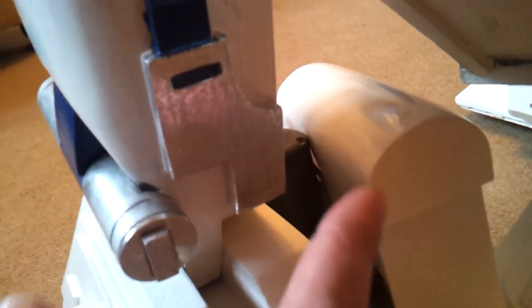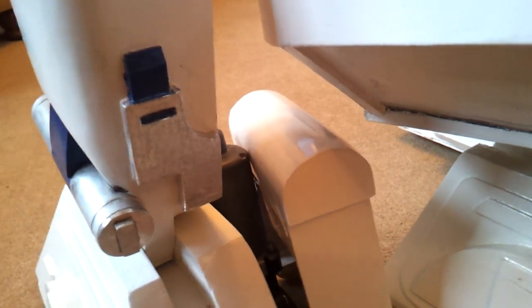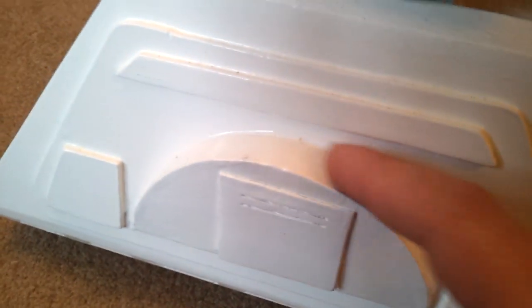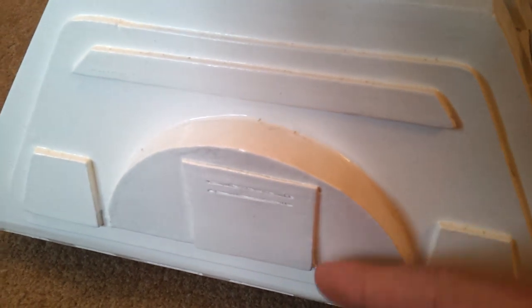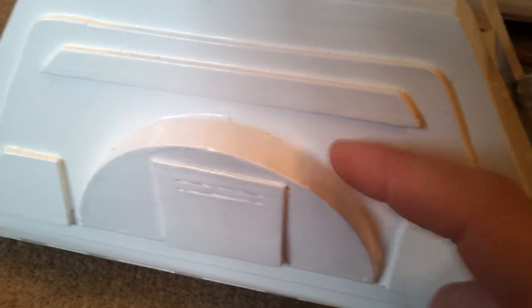Here there's a moulded piece of fiberglass and filler. This is actually MDF where I glued foil on and then sanded it all back down to give it a proper worn aluminium look rather than glossy. The feet are essentially an MDF frame, and here we've got cardboard. I cover the cardboard in resin or superglue, and it just sets it hard like proper plastic and makes it really light.